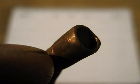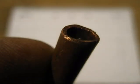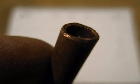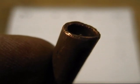Here's a close-up of the actual pipe where it goes into the propane burner. This end of the copper pipe, where the propane goes into the burner, actually sticks into the burner itself, and this end is where the propane hose is attached, going to your regulator. This is where the propane actually comes into the tube. As you can see, with both ends there's no jet or orifice. It just sticks in a little bit like that.